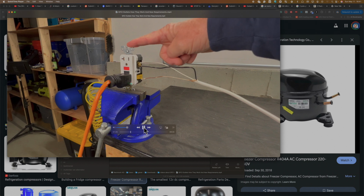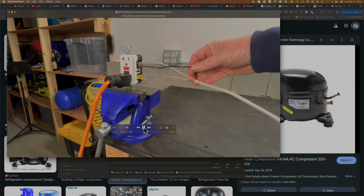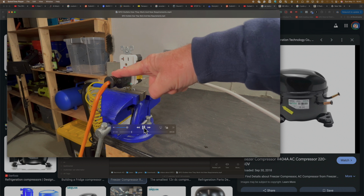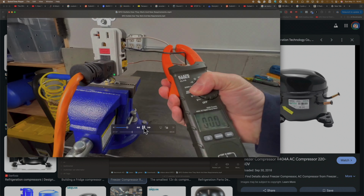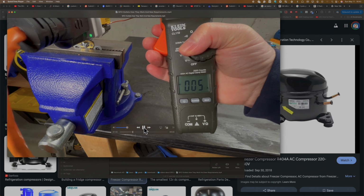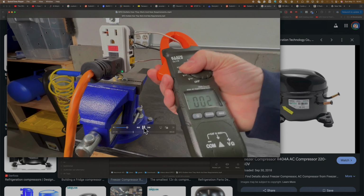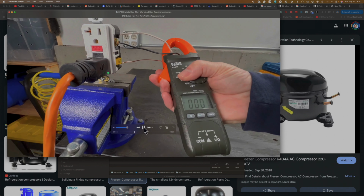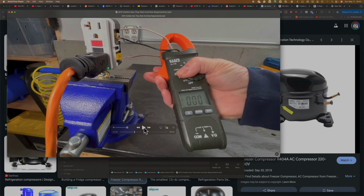Okay, so here I'm going to show you, for instance, we have a GFCI and we have the wires exposed, so that way we can measure it with the ammeter. As you can see, we have the black wire and the white one, and we have just a heat gun on that end, so that way we can measure the power consumption. As you can see here, we have 5 amps in the black one, which is the hot one, and we have the same in the neutral. So everything works as it should. Now, if we measure both together, we don't have any flow. It will not detect anything because one is balancing against the other wire.